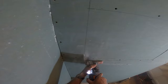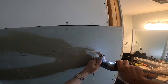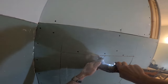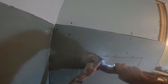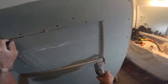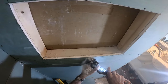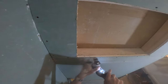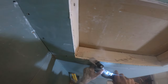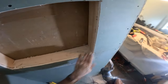I'm usually building my niches on the back wall — the long wall. In this case the customer wanted it on the rear wall. I'm usually building them about 12 inches, putting my studs in at a 17-inch mark to get 12 finished. Because the top and bottom studs I put in horizontally at 17 inches — by the time I put backer board, tile, thinset, all that stuff — it comes out to about 12 inches or so. On the back wall I frame about 36 inches between studs, but by the time everything is built out it's usually about 28-29 inches finished — so about 12 by 29.